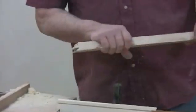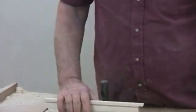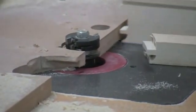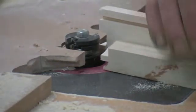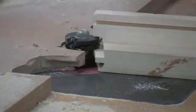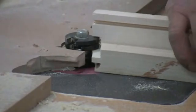Remember when we did this end, you could see how the bit wanted to pull it in? It's going to do the same thing on these narrow ends. Okay? It can try, but that's why you want that bearing dead in line with your fence. See, all we did here was, and this is just a safety thing, we had our miter slide a little bit loose because of this space, so we could come in here and basically do the reverse of what we did over there when we cut the top rail, where we freeformed it. We're just doing this in a smaller area.